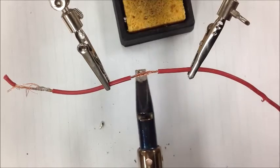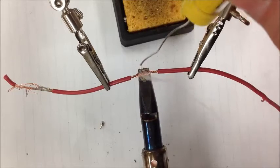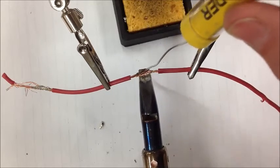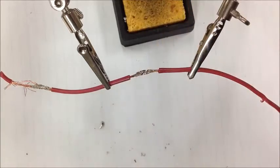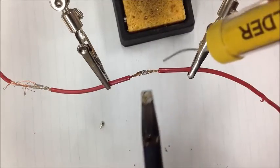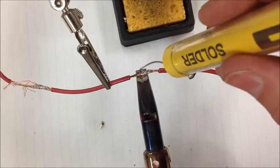I've been pretty hot here, so we're really trying to get it where it just flows through the wire. I'll touch down. You see how I tinned it, it gets on there, and I can pull away. Our risk is, if we're not going to heat shrink, I mean, we're going to heat shrink this, I'm sorry, but you could see where I would like maybe a little bit more just around these bare wires here